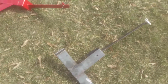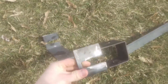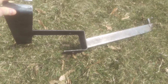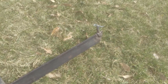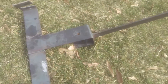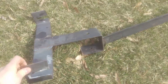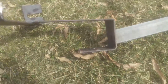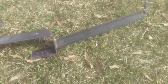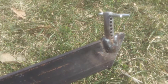We haven't painted it yet — just finished it up yesterday. This saddle part is 3/16ths inch steel, and we cut the slots deeper so it would fit a few different tractors. We found that the length from the eye down is about an inch difference between some of our tractors, so the deeper slots let it fit several tractors. The bend is 3/16ths, that section is four inches, with a half-inch bolt running through to hook up your wagon, and a welded pin with multiple eyelets.